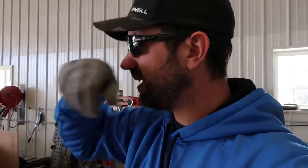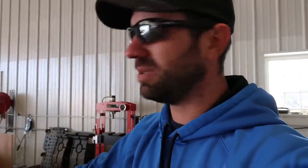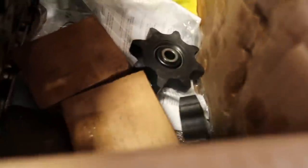Since we can't do anything today, we're probably going to rebuild this head and put new chains and sprockets on over the winter, but might as well do it now. Deere's got what you call a Row Max upgrade kit — it gets you a couple of gathering chains. It's essentially just an upgrade kit to make it a little bit more like their later 700 series head. We have the 600 series head; I think this is a 2015 model.